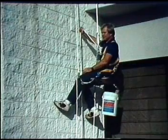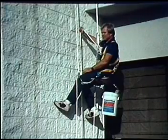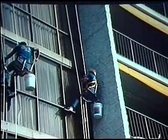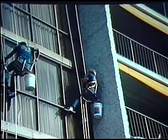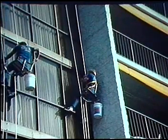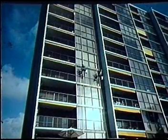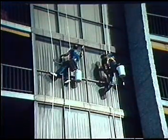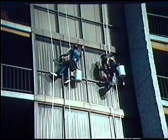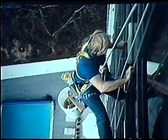Once you begin to learn the ropes, you can practice on 5 to 10 foot descents until you feel comfortable controlling tension on the line. Repeated practice makes perfect, and learning to use the Sky Genie correctly offers a quick, safe, and simple descent from high places. That could mean the difference between life and serious injury or death. The Sky Genie is invaluable to professional window cleaners, and for obvious reasons. When attached to one of our seat boards, the Sky Genie gives the cleaner complete freedom of both hands. And it allows him to hang safely suspended in midair.